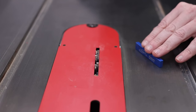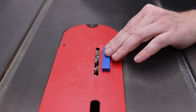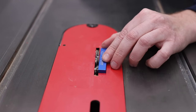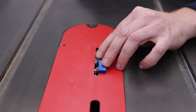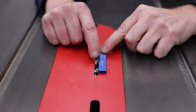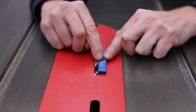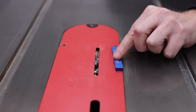Now let's go set up the table saw. The first thing is setting the height of the blade. We're using 12mm plywood, so I want to set this to 6mm. I'm using a 6mm spacer block — these are extremely helpful for tasks like this. I slowly lower the blade, referencing one of the flat-grind teeth, until I'm perfectly in alignment. Moving it back and forth to confirm it doesn't peak over the top — perfect. The blade height is set.